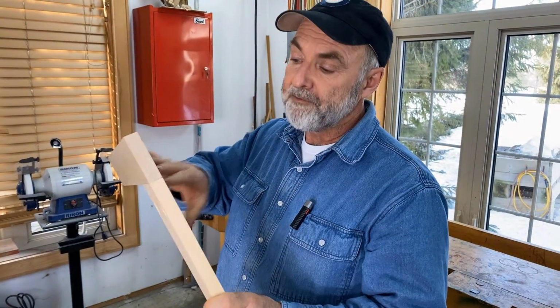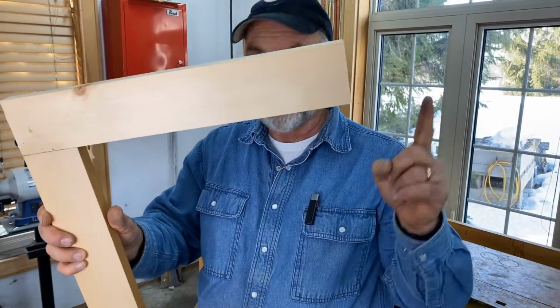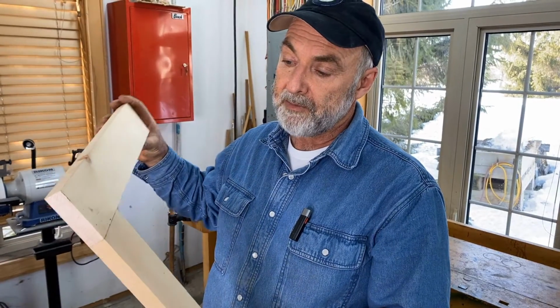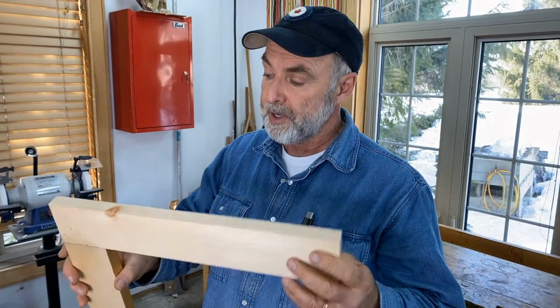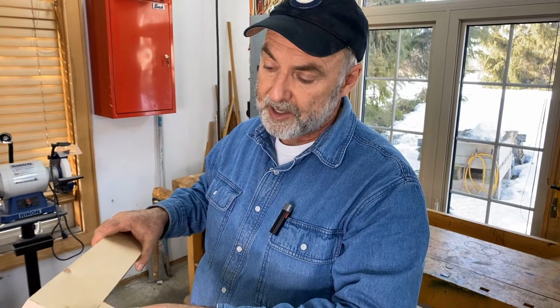doesn't look great from the back, but that's okay, because everywhere you use these, like for instance, pre-assembling a face frame. Imagine a four-sided frame like this that forms the front of the cabinet. Perfect for pocket screws. Door and window trim, another great example. When I install door and window trim, especially stuff I make myself, I make the frames into a complete unit, four-sided frame, joined and even finished before it goes up. It's a lot faster. You get perfectly tight joints and they never come apart.